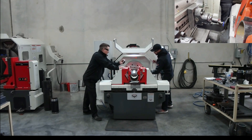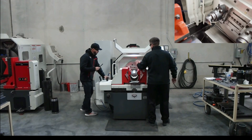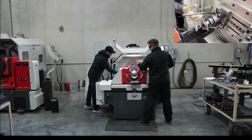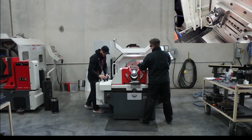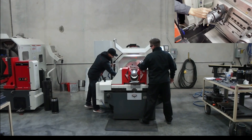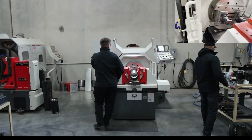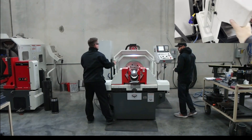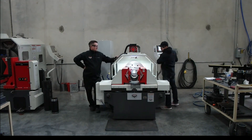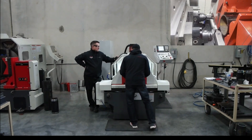So he just inserted a threading tool. Now he is going to pull the cut groove blade out. Now if you have high production cut groove we could build or get a blade that is the exact size of the cut groove. We like a blade that you can do all the cut grooves with. That is a facing tool. So we just basically move the machine to start position using our tool again to reference the pipe.